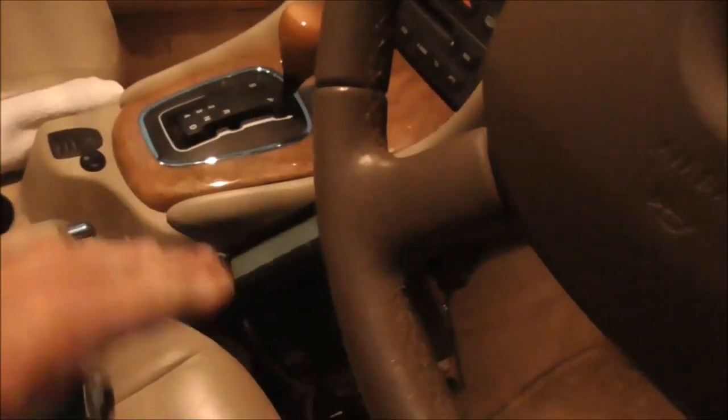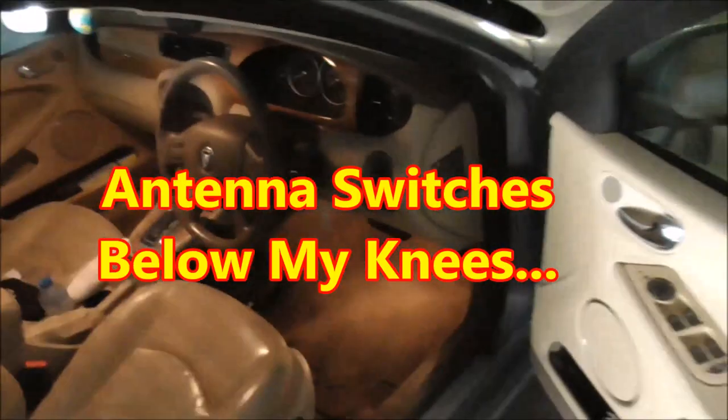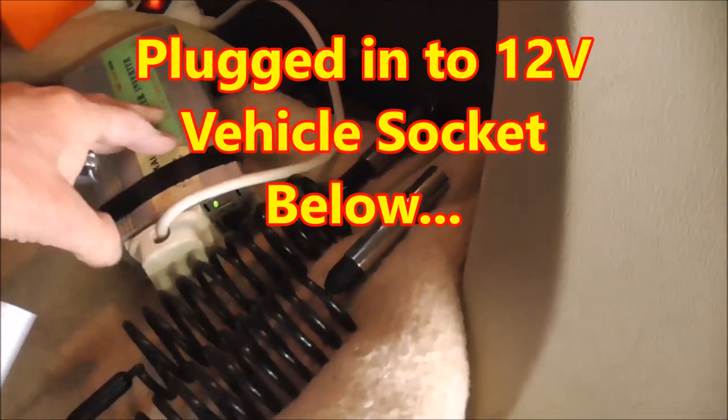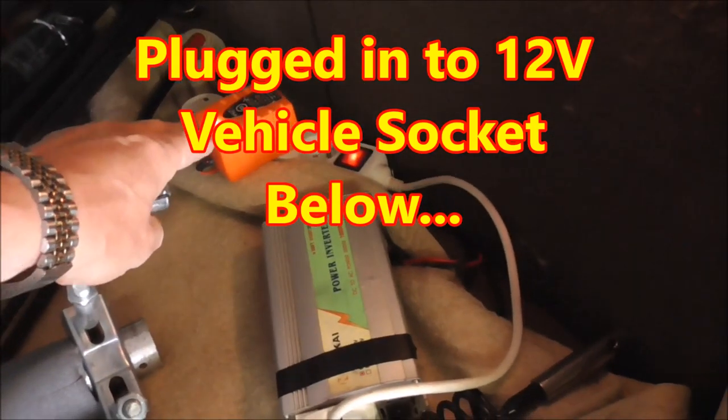I have in the car here the Fox Tango 891, the FT891 radio, which sits just nice and neat in there. Of course, I've got the kit that I made up for the fascia, so when I'm DXing, I can put it up there and it's nice and handy. It's powered, the car's an automatic, so I can't afford to be somewhere remote and the battery runs down the car. So behind the seat here, I have a camper van battery that powers it all. And I charge that when I'm on the move, just by switching on the inverter, mini trickle charger, and it works an absolute treat.